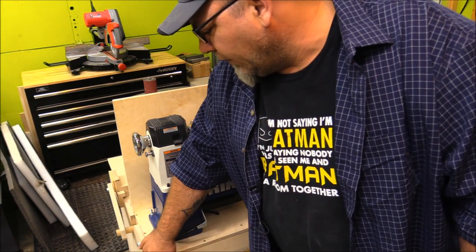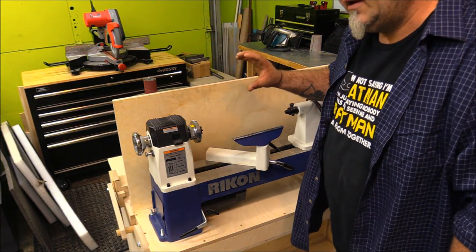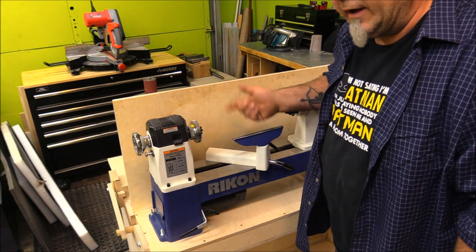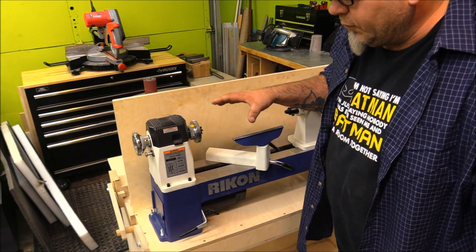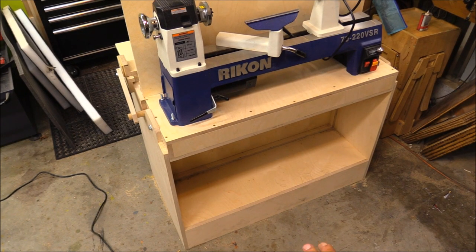There's a locking point here and on the opposite side, so if I put something off-center with some mass to it that vibrates, any movement will be eaten up by the locking points. In the base there's a seven-inch rise — I'm pretty sure that's enough weight — but if it's not I can put a plate underneath and add some bricks to it, then attach all of that to the cabinet to help with any other vibration.